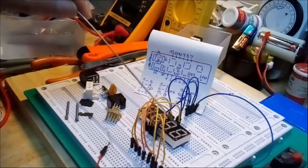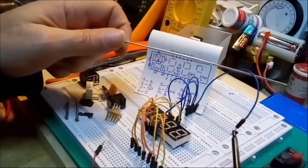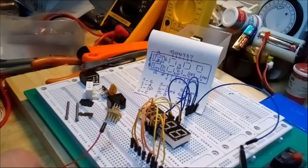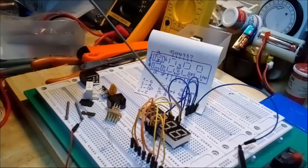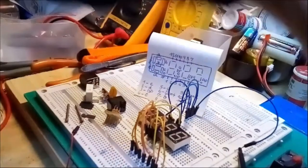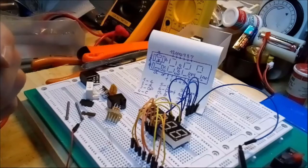So in order to make these light up, you connect each little LED with its cathode to ground, which in this case would be the blue wire you see here, and all of its anodes with a red wire, which is this one here. And since these are all red LEDs, and red LEDs need very low voltage to function in general, a red LED will light up quite brightly